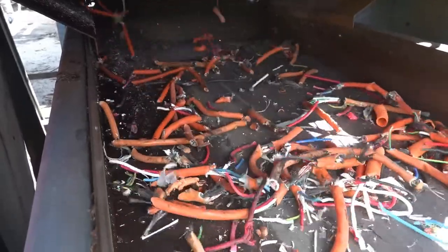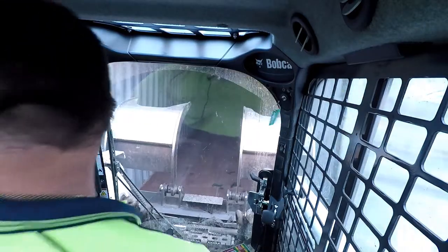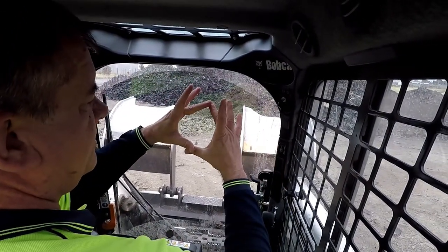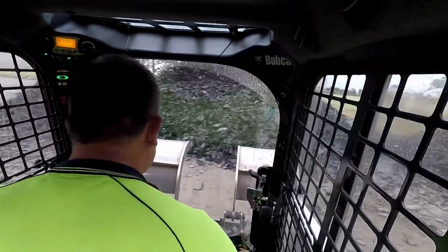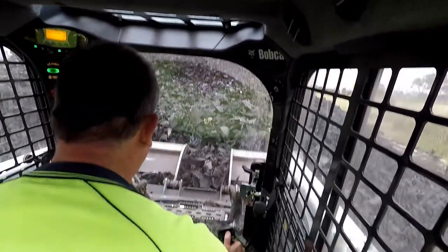It's pretty powerful, but the next machine that follows it isn't as strong. So if you get large pieces of steel going through, they can actually damage the knives on the second machine in line, which is called the rasper. The super chopper chops tyres down — sometimes you might have a piece that's sort of this big, sometimes it breaks it down to something like that, and sometimes even smaller. The rasper actually breaks that down to even much smaller sizes — something maybe the size of a 5 cent piece or a 5 peso coin.